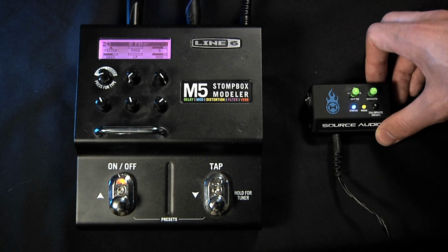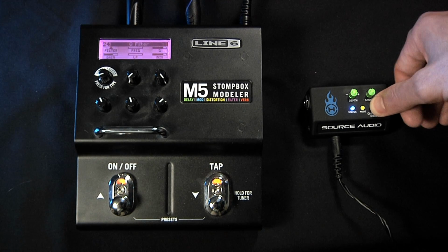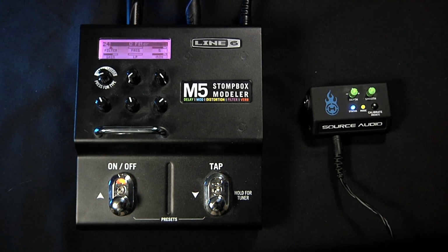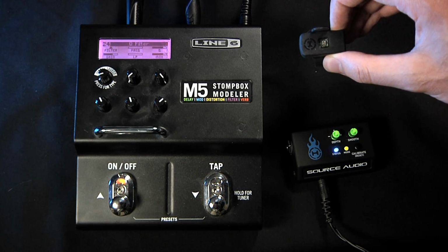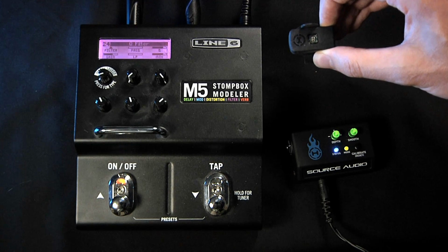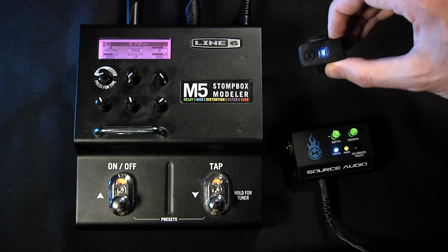After the desired axis is selected, press and hold the calibrate button until the unit resets. It will take a few seconds. After the unit has reset, the status LED will blink, indicating that it has not connected to a Hot Hand ring. Turn on the Hot Hand ring and it should connect to the receiver. This is indicated by a solid blue status LED.